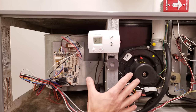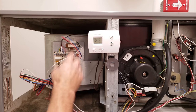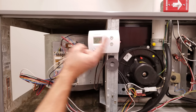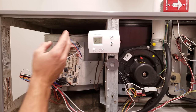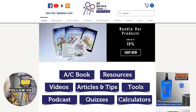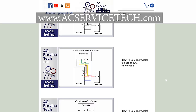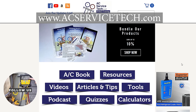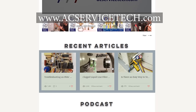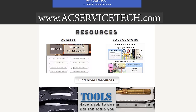So I just took you through all the reasons: it starts with the power coming in, then low voltage, the signal to the thermostat, when the thermostat sends a signal back to the board, then the power to the inducer motor, and the inducer motor itself. Make sure to check out all the free resources we have at ACServiceTech.com — thermostat wiring diagrams, articles, quick tips, quizzes, and HVAC calculators. Hope this video helped and you enjoyed it — we'll see you next time at the AC Service Tech channel.